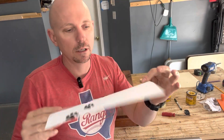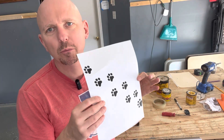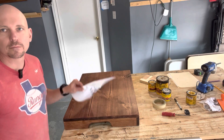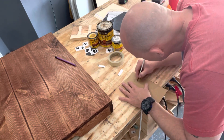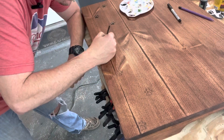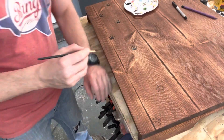The customer chose red oak stain. She also wants some kitty paw prints going across the bottom of the stove top cover. I'm going to transfer the image from a paper printout — a perfect full-size paw print — and either wood burn them or just straight up paint them. The carbon paper didn't work out, so instead I made a little stencil: traced it onto cardboard, cut it out, used a marker to trace it, then went in with some black outdoor paint that I use on most of my projects. You can get it at Walmart — it's really good, cheap paint, great for projects.